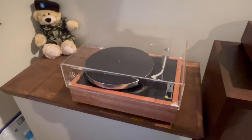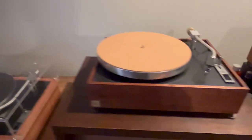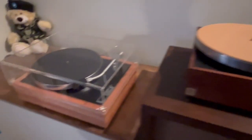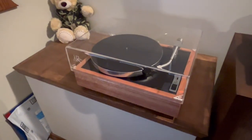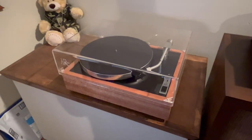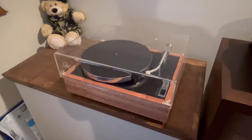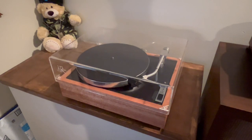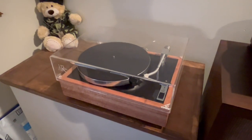I think that's all, but I wanted to show you that, from the Frankentable, I have slowly improved my woodworking skills. I replaced my table saw. Again, some of the miters aren't real clean, but I found out that you have to really take a lot of time to set up your saws correctly to cut 45-degree miters. And I didn't do that.